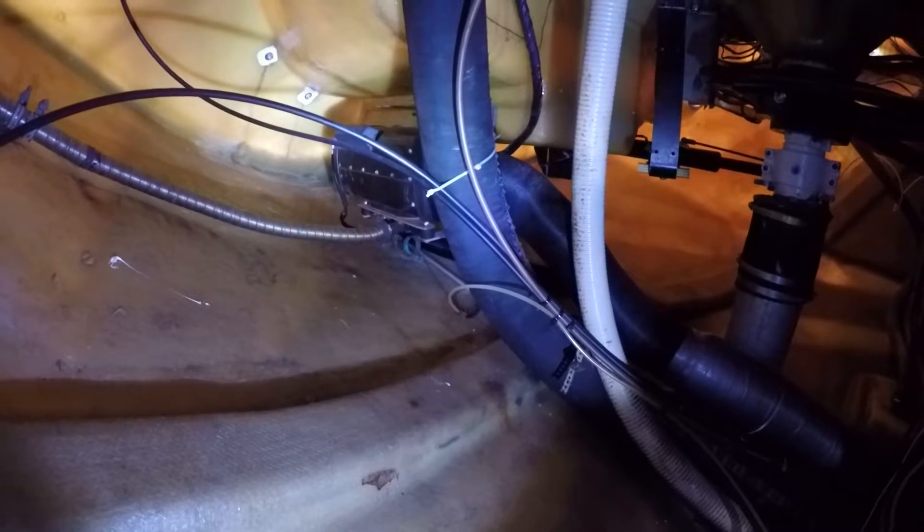This is the diesel heater set up in my boat — it's an old Eberspächer diesel air heater installed probably 20 years ago. We've had the boat 10 years and have been using that heater for 10 years. When putting a heater in a boat, it needs to be installed fore and aft and as close to the center line as possible. These heaters can tolerate rolling movement much more than pitching movement, so particularly in a sailboat you must mount the heater fore and aft and close to the center line. In a multi-hull or power boat those issues are not so critical.